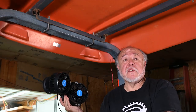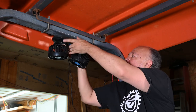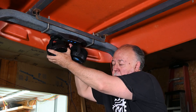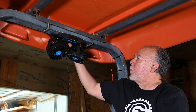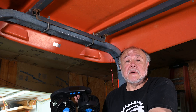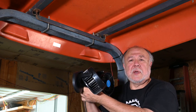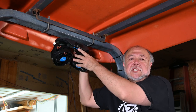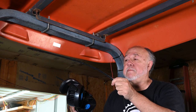Now it's time to actually mount the fans. I want to mount them right to the bottom of the ROPS bar here. Let me just try this out — yeah, I'll be able to adjust it just like that. Being able to blow right on the back of my head and shoulders should work pretty well. It's designed to be mounted using a double-sided adhesive pad. That stuff usually works pretty good — the automotive-grade stuff used for mounting car accessories. That's fine for something mounted horizontally or even sideways, but vertically I don't trust it. There's that constant pressure, and in my experience through heat and cold cycles it eventually turns loose. So what I'm going to use instead is these really big heavy-duty wire ties.